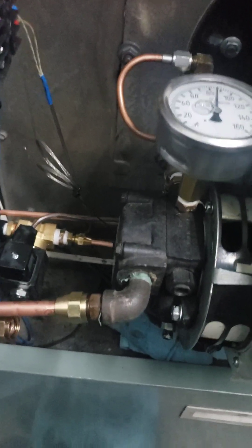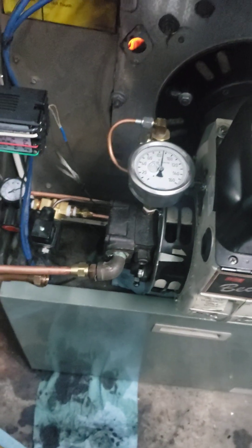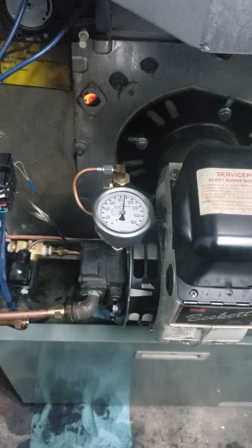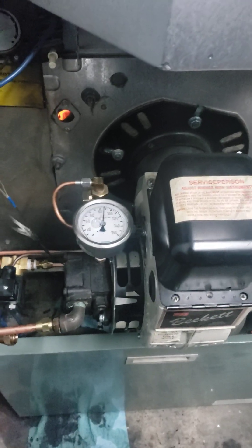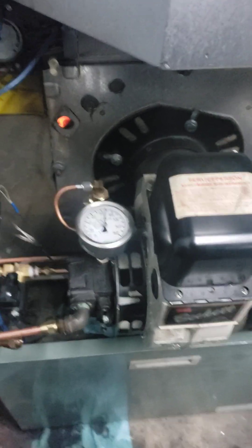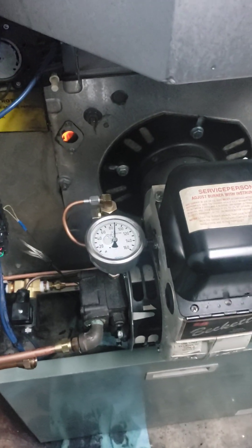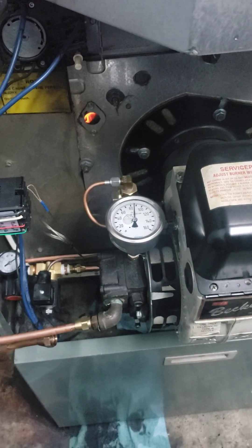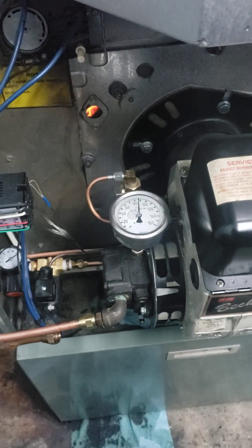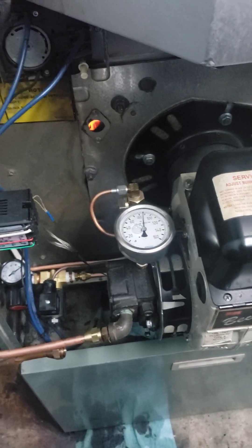The oil comes into the pump, and I'm using a siphon nozzle. Some of the well-known guys who sell these components scolded me a little bit for trying to use the pump with the siphon nozzle. But now that I've got it running really well, I would take this over a pressurized system, gravity-fed, whatever — any day. It works way better and way more consistent.